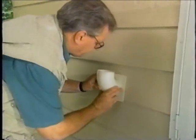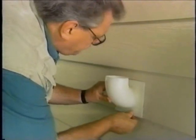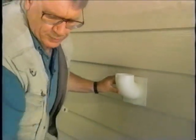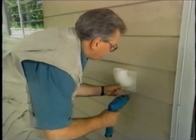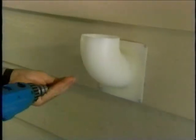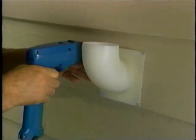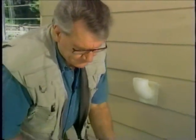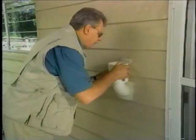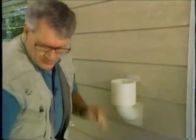There you have it, nice and sealed, nice and tight inside — you can see it's all in place. Move it up into location and we'll put four screws in. The caulking will even hold it in place, just like another set of hands, sealing it nice and tight up against the cedar siding. You can see the caulking is blossoming out, giving it a nice seal. Now to set the canister on top — see it fits nice and snug — we'll put two screws in the canister.